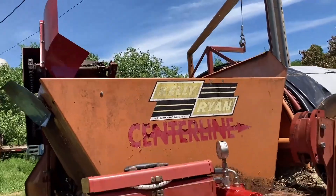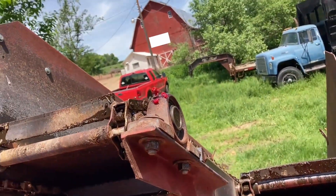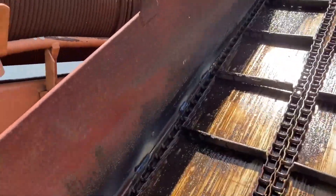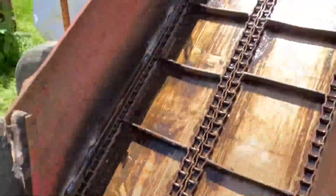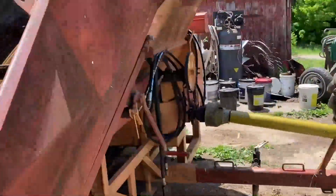We can take this big blue shield off to keep feed from overflowing in the front, especially when it's not perfectly level. We added that bracket, then this bearing was out so we put a new bearing on. I also saw the conveyor on the side had been hit too many times by chopper boxes, so I went down and re-tack welded that on, oiled everything up good.